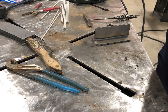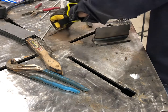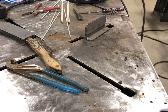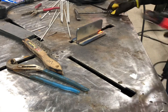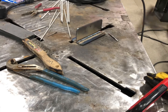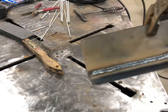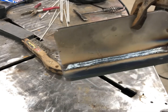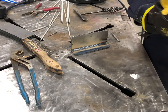We'll go up to about 120 amps and run our 1/8 inch rod. My prediction: same as the last three beads. Amazing — look at this! Small machine packing a good punch. I have no complaints whatsoever with stick. Really easy setup — hook up your DIN connectors, put it on MMA, set your amperage, and burn rod.